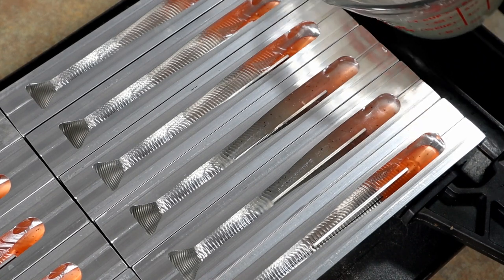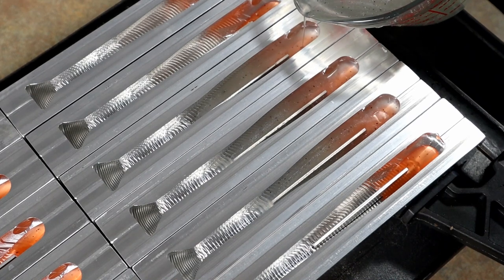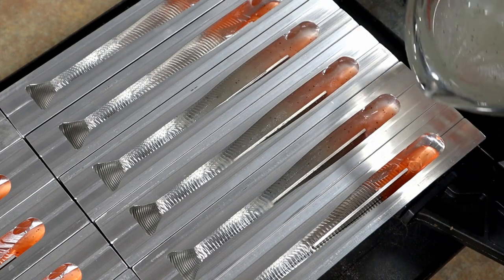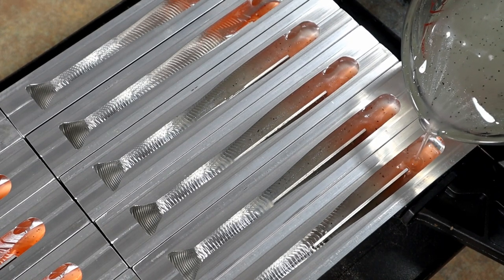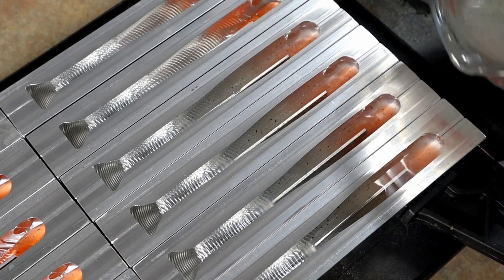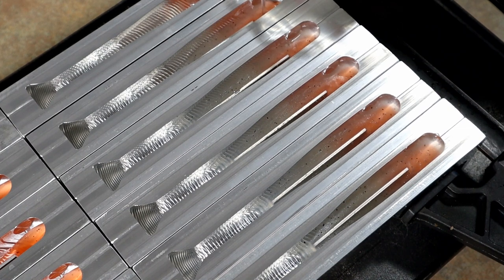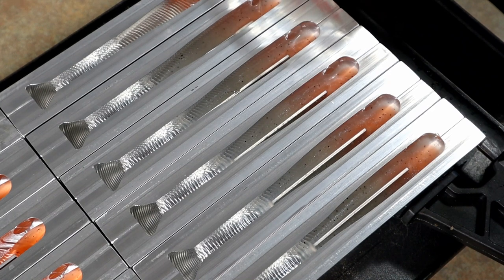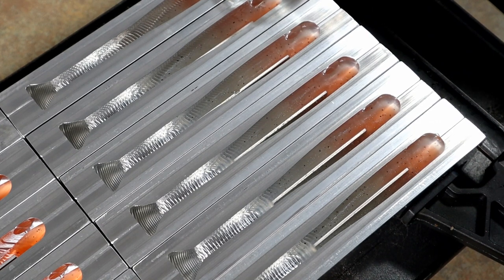While I'm doing this I'm really paying attention to how the plastic is flowing. If the molds are way too hot you can kind of tell by the way the plastic flows — this right here looks and feels really good. I'm pouring this belly plastic right at about conversion temperature, about 350, because I want to pour it hot so it flows more evenly and we get even laminates. These molds are still on 350 and I'll actually back them down here in a few minutes. There's a point where I notice the way the plastic is behaving in the molds where I'll actually back the heat down.